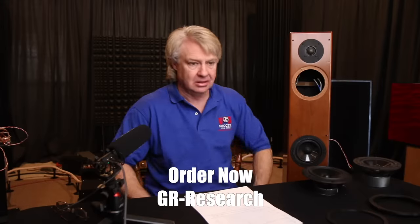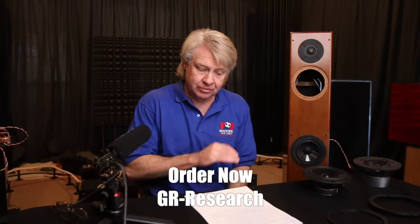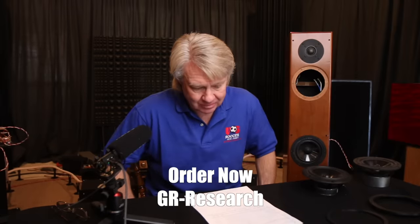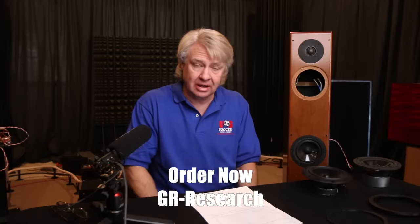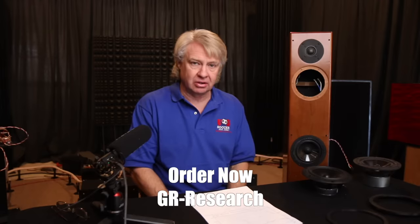That $618 kit will transform a broken speaker with nice-looking cabinets into an actually great-sounding little speaker — almost 89 to 90 dB sensitivity, so easy enough to drive for good output levels. The M130s always sound fantastic and they work well with this tweeter. It was a rare moment that we could pull off a driver-swap upgrade and still make it affordable and make it work. Thanks for watching — hit the subscribe button if you haven't, and I'll see you guys in the next video.